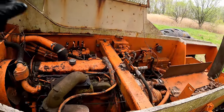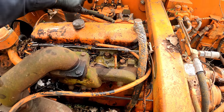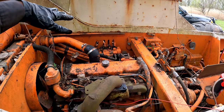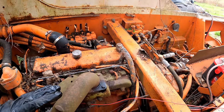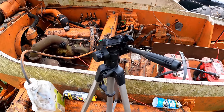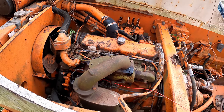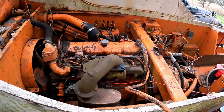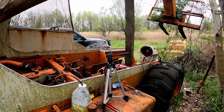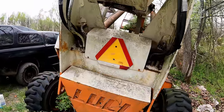Don't even know what engine this is — maybe it's a Cummins or a John Deere. If you have any info, feel free to drop that down below. Will it run? Yeah, on starting fluid — which is horrible to do for diesels. That's why it's making that really loud knocking noise, because this stuff is extremely volatile. A diesel engine is not designed to run on something like that — diesel is much less volatile. It's kind of a shame because the motor sounded good. We did get the boom to go up a little bit, so that was cool.